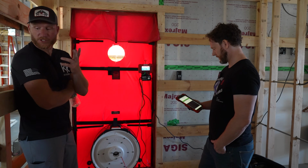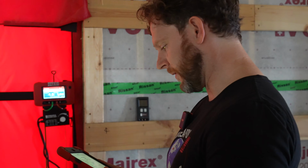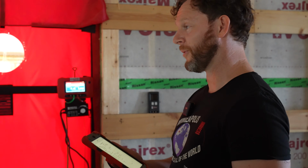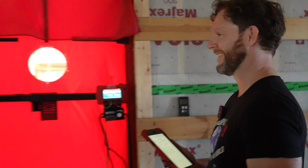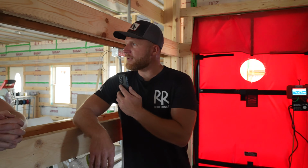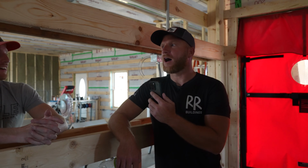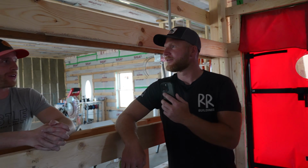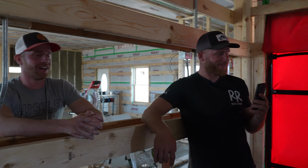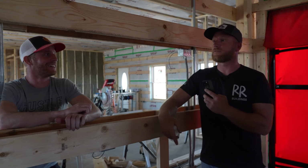Yeah, I've never spent this much time on an interior air control layer. What was our CFM? You're now down to 169.5 and ACH 50 of .43. Were we .44, Randy? I think we were .44. Was it? I think it's the same. I think it was .43. Either way, it's still pretty good. It's a lot smaller house. No spray foam, so yeah.